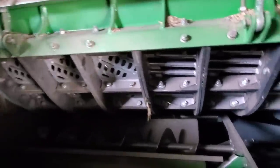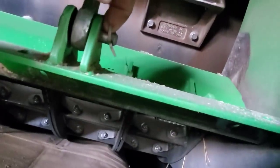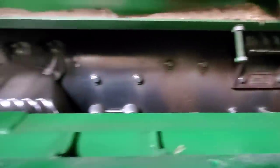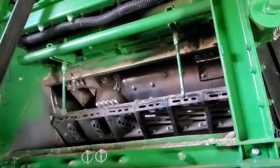I got those bolts out of this plate. I need a pair of pliers to take the cotter pin out so we can get that whole plate out of the way. There you can see the rotor — these are the threshing elements that grind the crop against the concaves. That's what separates the grain: gets the wheat out of the head, the beans out of the pods, the corn off the cobs. That thing spins around really fast — that's how it works.